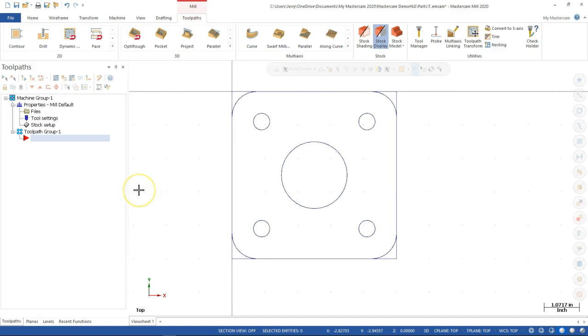All right, so it's time to decide what I was going to do with the 5x5. So if we find the stock in 5 by 3.25, 3.5, then we're going to still use the sacrificial material. If I need to do this as a separate, then I'm going to have a first operation that's going to kind of square this up so I can just deal with the radiuses.